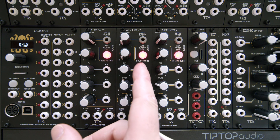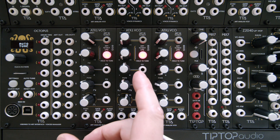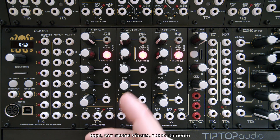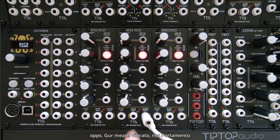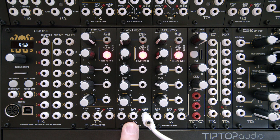In ART mode, the FM input is quite narrow, and the reason for that is because it's mostly emphasized for portamento effects. SYNC is provided as well — it's an interesting effect as it takes things coming out of the oscillator and makes them a little more metallic. There's also a gate out used in ART mode. When ART receives notes on the ART input, you will see the gate out LED flashing, and the gate signal sends to your envelopes, sequencers, or whatever.